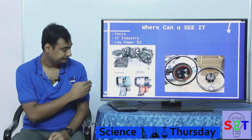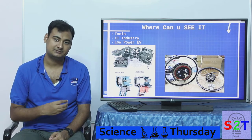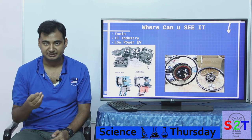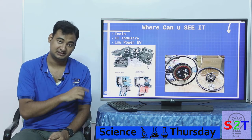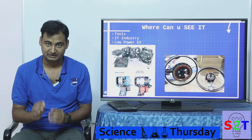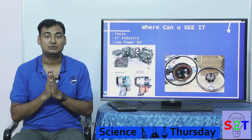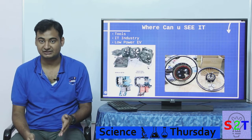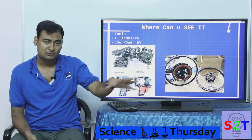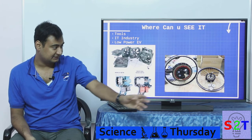The power tools industry — drills, hammers, and similar tools — is now generally shifting to brushless motors. The reason is efficiency: with a brushed motor you might get 30 minutes of operational time from a battery pack, but with BLDC using the same battery you get roughly 40 minutes. That extra 10 minutes is a godsend for professionals who use these tools daily.